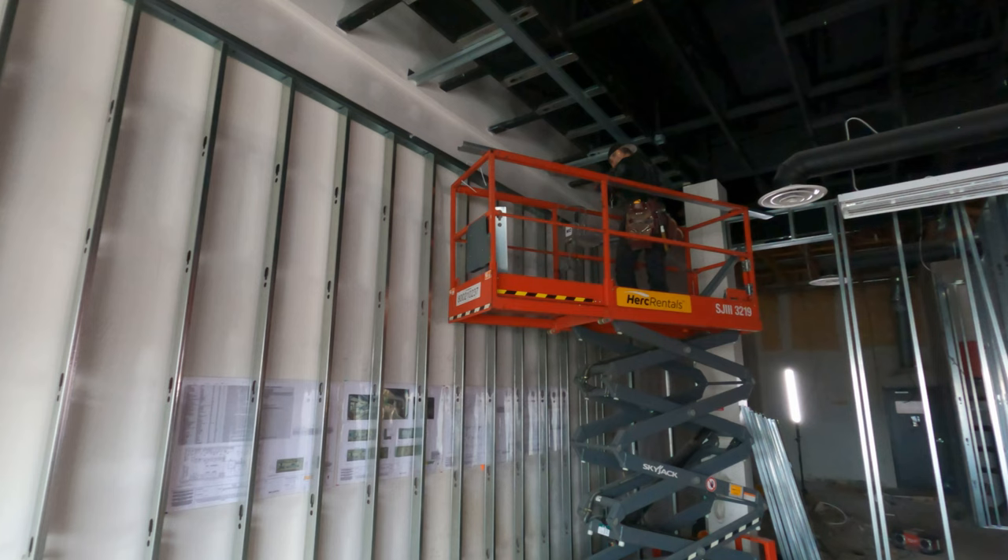As a bonus, let me show you the back furring wall. This back furring wall has a piece of track screwed in facing the wall, which lets us get screws into the studs of the back wall — super strong. We set this stud at elevation: so for 10-foot studs, we go up 10 feet and a half inch. That way we just screw our top track to the stud — studs are cheaper so we use a stud back there — and you can also put screws in through this track to the back wall.